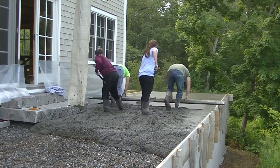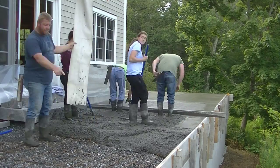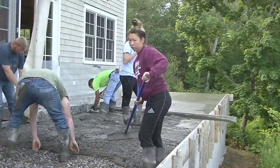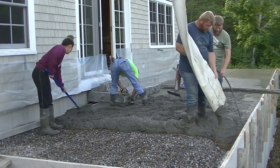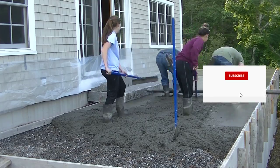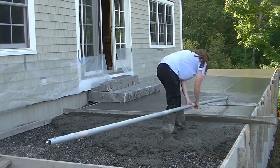What we're doing here is pouring this concrete patio. We're using gold gray in the concrete for our color and we always mix our color into the concrete. I order it from Marshalltown, it arrives at my house, and then I bring it to the concrete plant and we put it right in the concrete trucks when he's batching the concrete. So the color gets mixed in all the way to the job site.